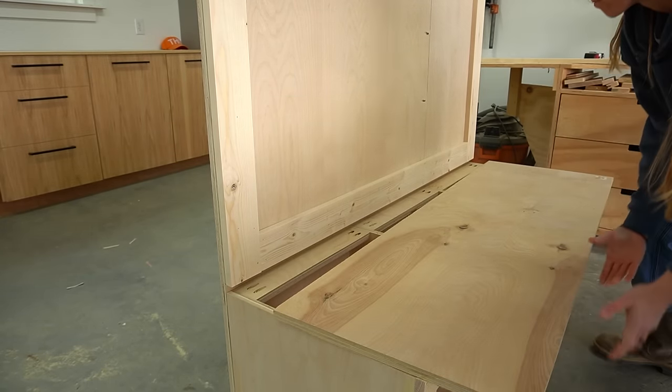I'm not a paint snob, but I personally like Sherwin-Williams paint, and my friend chose this color so that's what I got. I apply paint just like primer — brush first, then roll. I let the first coat dry to the touch, then applied a second one and it covered really well. Sometimes I have to do a third coat, but thankfully this was good after just two.